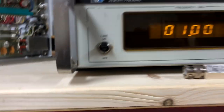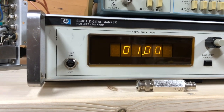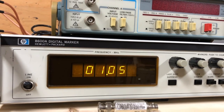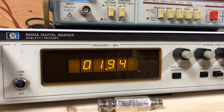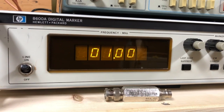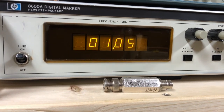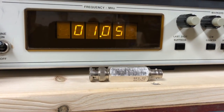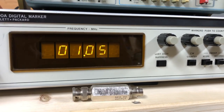The first step says to go from CW mode to symmetrical and see what happens. If I go from CW to symmetrical, it jumps up 50 kilohertz. Go back to CW — it's back down to one. When it's in the symmetrical sweep position, that's when we make our first adjustment on the FC minimum. I'm going to try to get it down to one.